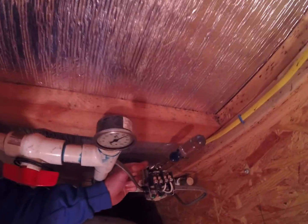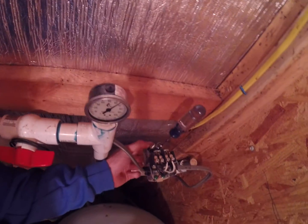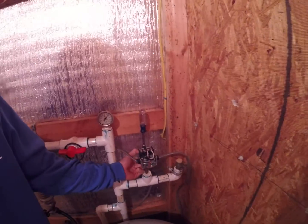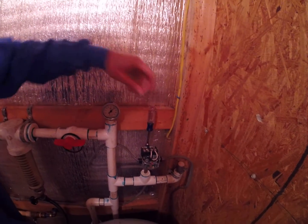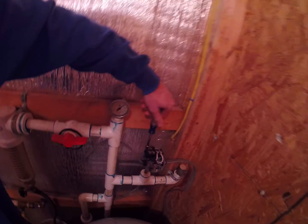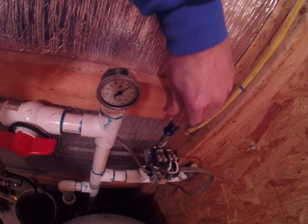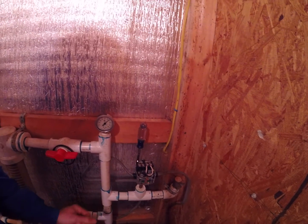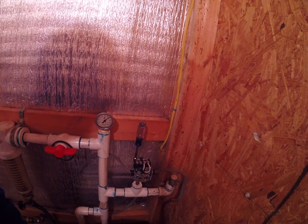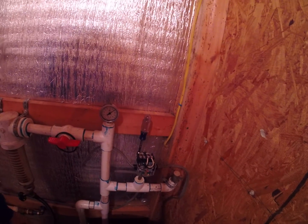You can see there's this little lever back here that I have my thumb on. You can match this and test out your new settings on your switch. You can see mine is set around 45/65. I'm going to compress the smaller spring about four or five turns and then match this lever to show you. So it's climbing — it'll probably cut off around 70 or so. Yeah, 69 pounds or so.